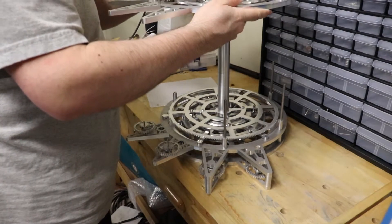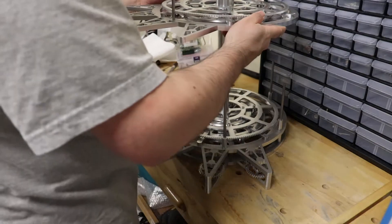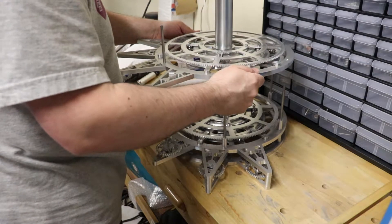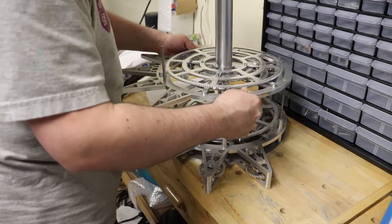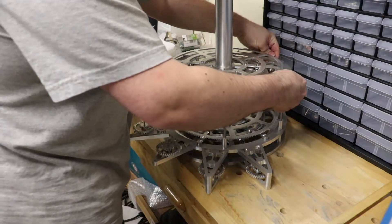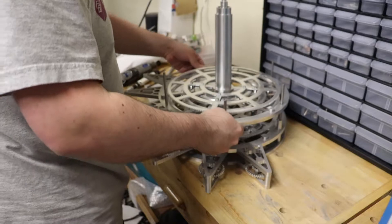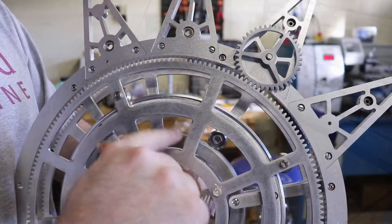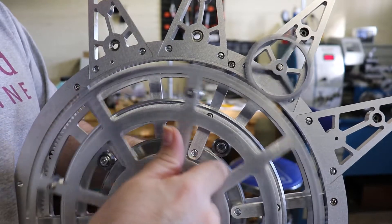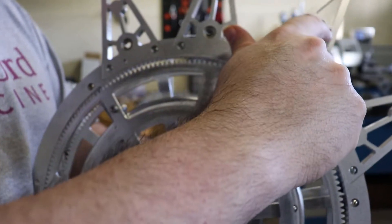Here I'm installing a ring assembly to the full display stack for a test fit. I must make sure everything aligns well — that gears from this ring do not interfere with the previous ring, and that the planet arbors are concentric enough so that they rotate freely. This step can be a little time consuming, so we're going to move on ahead. It takes some adjustment to get everything to fit perfectly. And speaking of perfection, here is a test to see how well a gear meshes with the planetary gear. It doesn't get more perfect than that. This quality is checked for all nine planetary gears.